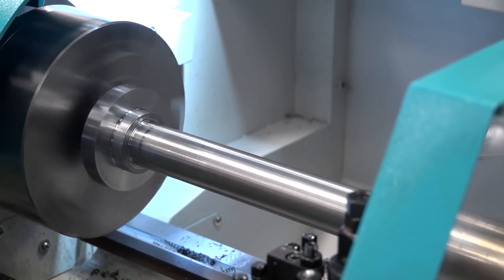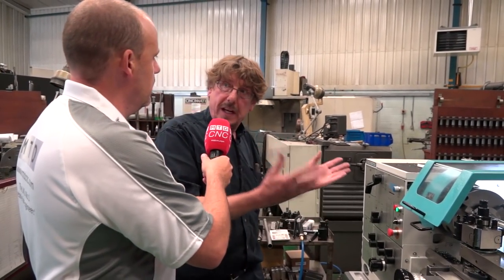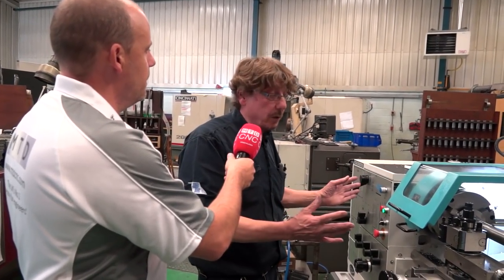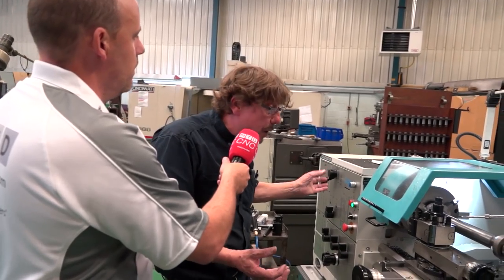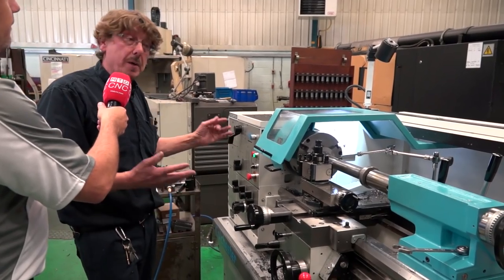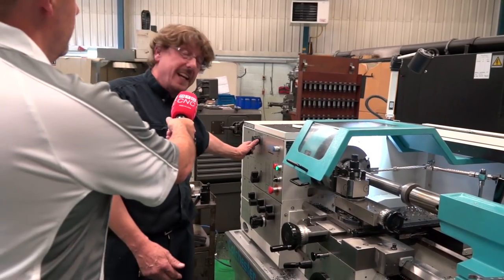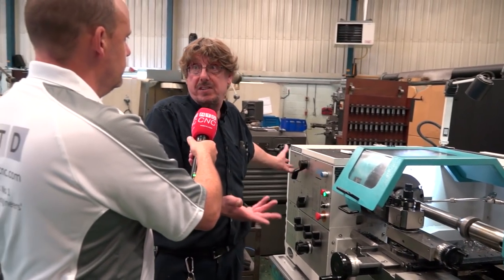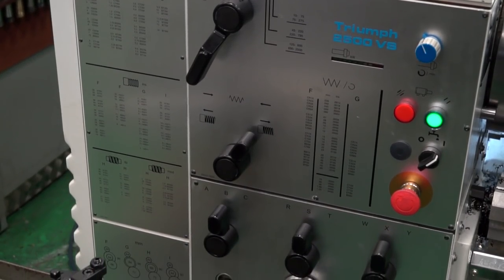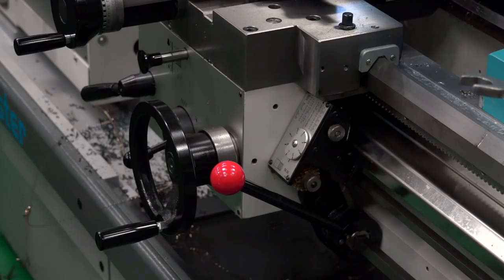What is that altering - the spindle speed and the travel speed? Altering the speed will alter the travel speed anyway because you're slowing it down, so you're going to alter the feed rate. Sometimes when finishing you may want to go higher. On old-style machines you'd have had to stop the machine, change the gear, put it into a different range, but on this one you can be in high range all the time and drop from 2500 to 695 RPM in seconds.